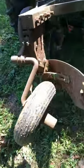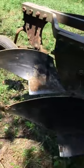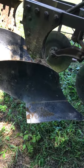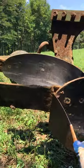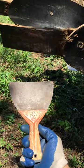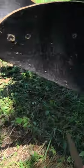You can see how these plow bottoms have started to scour. I spent more time on the front bottom — notice there's very little soil sticking to the surface of the moldboard, very little. There's a little bit out here on the moldboard extension. A putty knife is an absolute must when heading to the field, even if your plow bottoms are scoured.